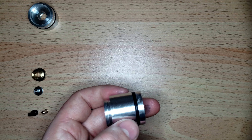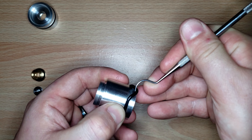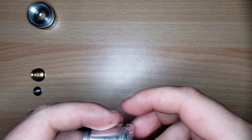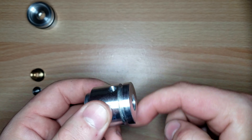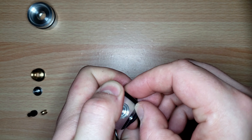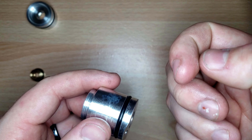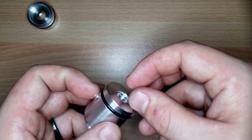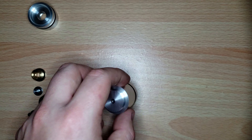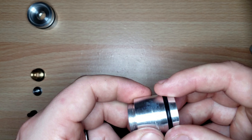For the next one — another 23 by 2.5 — use the dental pick, take it at the edge, slide it under the O-ring, and pull it up and over. With the new 23 by 2.5 O-ring, try to stretch it over rather than rolling it, because rolling can cause the O-ring to twist, which causes sealing issues. If you stretch it over, it will properly rebound into the groove and won't be twisted. Apply just a little bit of lube and go around.